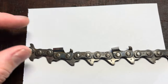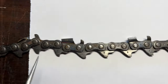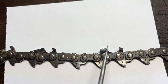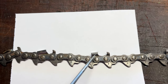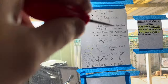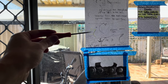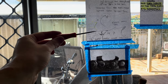That is a really nice side-by-side. A couple of things I've run into: when doing this, don't lift up because you're going to end up with a kind of ski ramp. Don't go too far down because not only are you going to remove the gullet, you're going to make the working corner too acute — too much of a C. The position of the file in the tooth will determine how the top working corner looks. If the file is too low, the apex of the C will be too low in the tooth and you'll end up with almost like an S shape — instead of the working corner being sharp, you'll end up with a bit of an S shape.